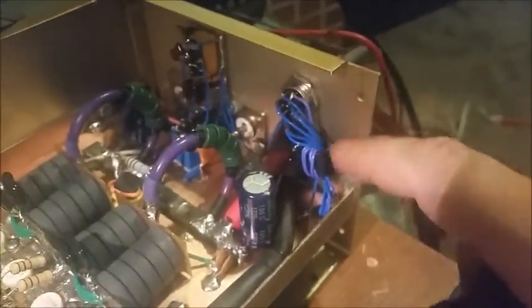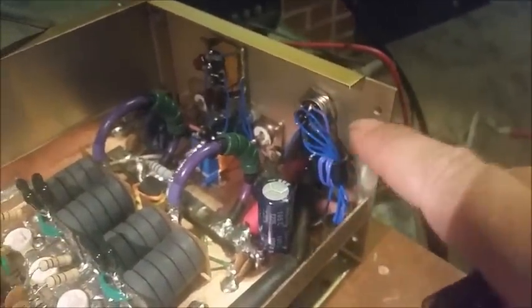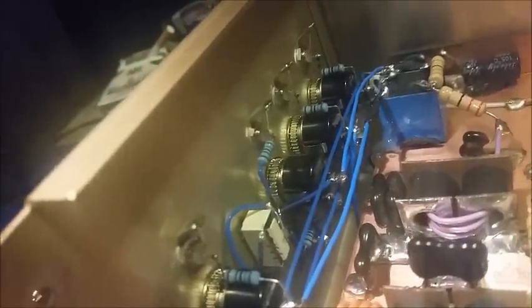See, that's something else I will always do. I always run an extra ground to the board. I don't care. I never rely on the case for a ground for that. Now, as you see with my LEDs, I run separate. I put tabs on the actual holders for grounds with that, but they are sanded down. Those are good grounds. Makes it good and clean. Don't have to run the individual wires to the board. Make it look all nasty. But never when you're actually relying on an actual ground for some decent current. Not decent, but current. You know what I'm saying? Other than an LED.